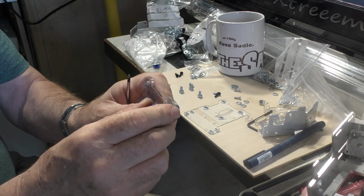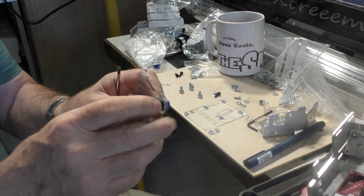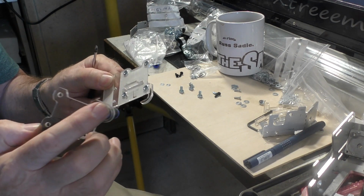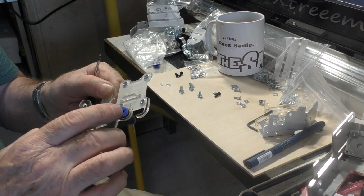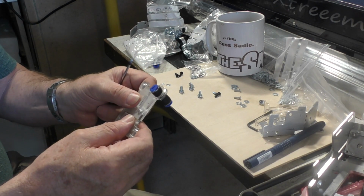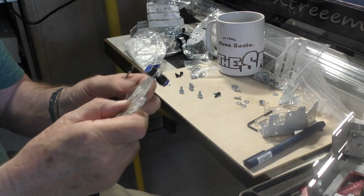And we'll push that through from the front side where the countersinks are, because there's a very slight taper on that hole and it goes in smoothish but with a little push. We've then got to hook the narrow waist of the fitting into that loop there that we've got on the back plate. Okay, now that captivates the fitting. We can then press the 2 plates together, and there we've got our basic assembly with the nuts that don't fall out.